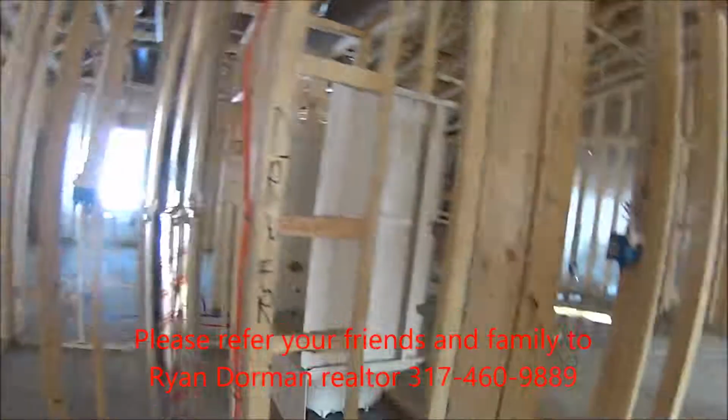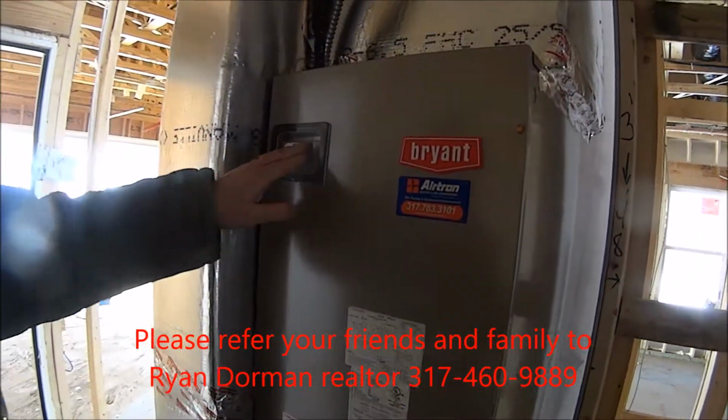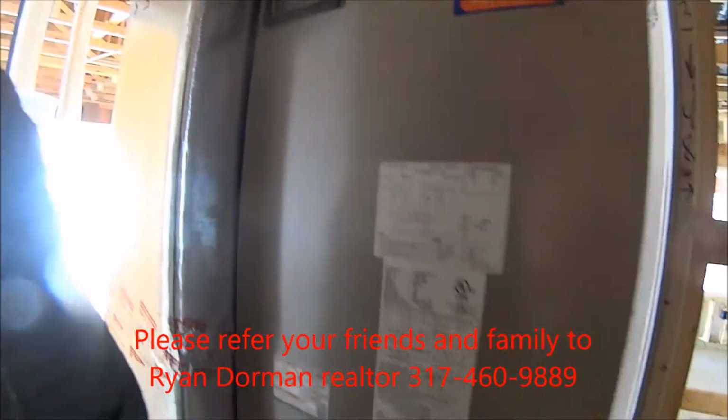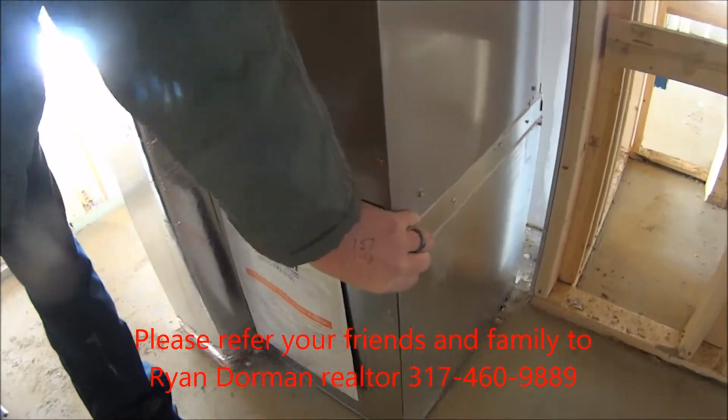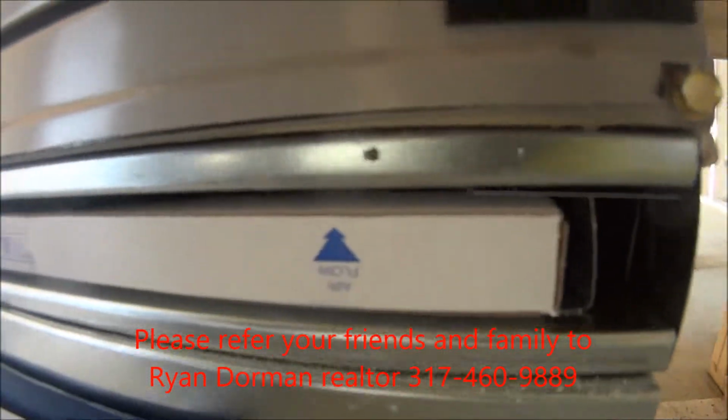Here at your furnace, so to change your air filter, what you would do is first you would shut this breaker off in here. And then you got a little lip down here on this here that pops out. Your air filter is in there.